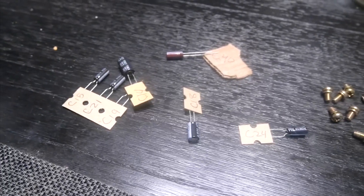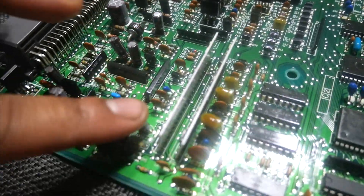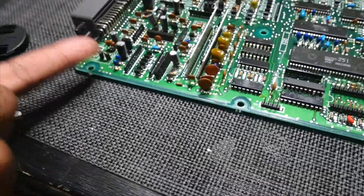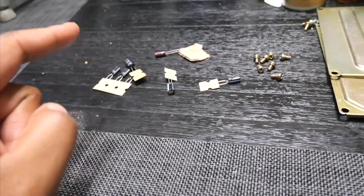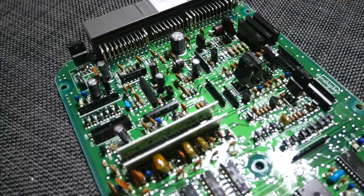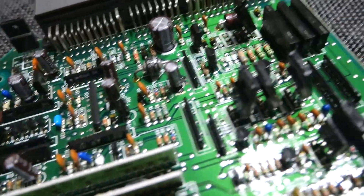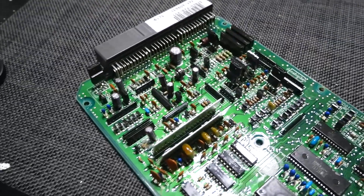The new capacitors finally came and I got them all labeled out with where they're supposed to go on the board — seven of them total. I'll have a link to these capacitors in the description below. One thing you have to check: make sure you're placing the right voltages. These range from 16 to 35 volts. Also, I'm not 100% sure if these are polarity-based but there are lines on each one and I'm pretty sure that means negative, so I'm just gonna match mine to the ones I take off.